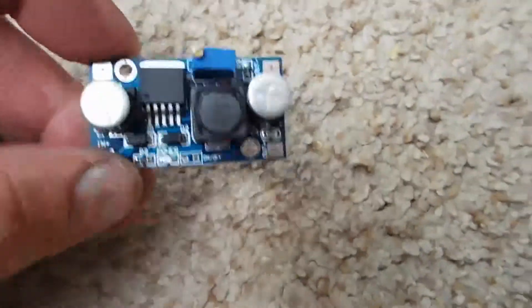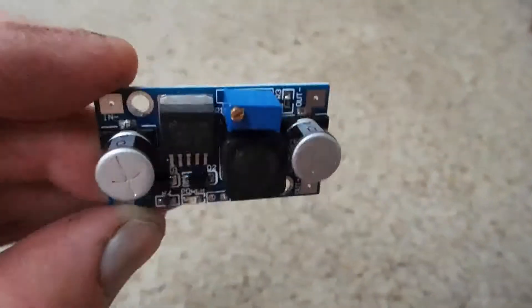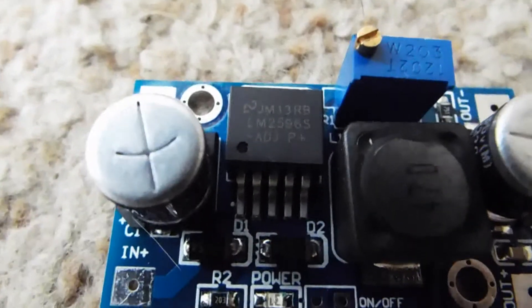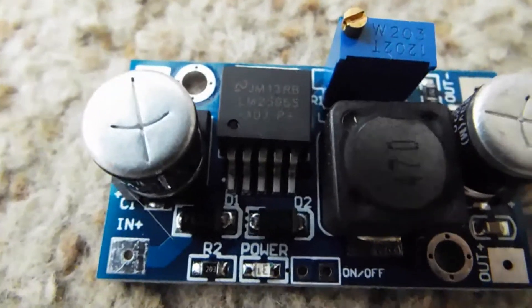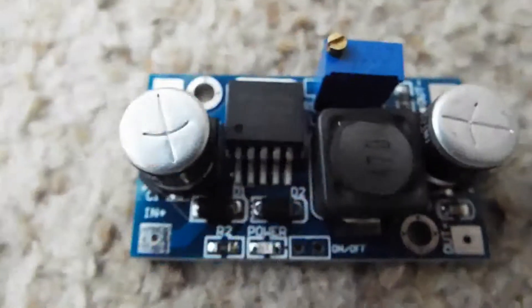In order to change it, we're gonna insert this little DC-DC buck converter in line with the power cord. It uses an LM2596, which used to be made by National Semiconductor — it's a simple switcher. You can get these boards on eBay for less than 3 bucks.